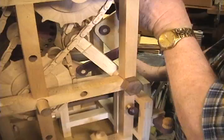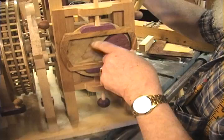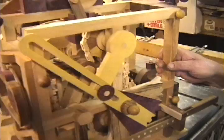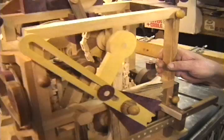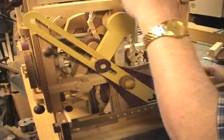And then here's some more bell cranks that work off of a crank down in there. And this converts rotary motion into reciprocating motion. And then this is another one that also works — rotary motion into reciprocating motion. This device here going around raises this frame up and down at different speeds. And there's a rack and pinion type gear here. This going back and forth on this crank makes this go at a faster speed across the bottom than across the top, because it takes longer to go in this arc than it does to go across the bottom.